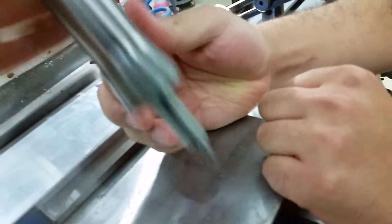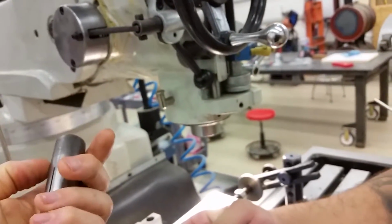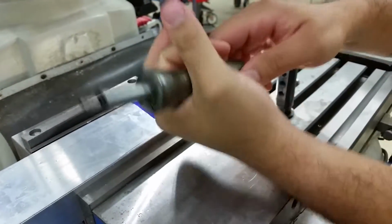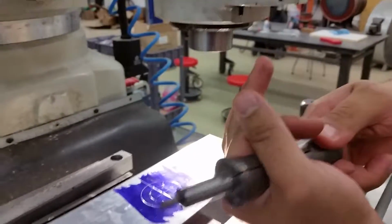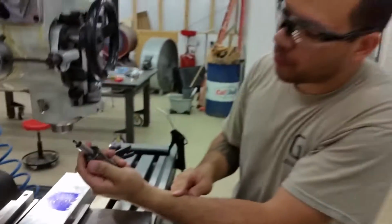First we should tell you that the other side has a threaded inside. And then when you pull this up, because you use the, this is spinning the threads of what looks like a dowel, but it's called a drawbar. Right. That pulls it up, which then squeezes it, and that is what keeps it tight in there. Yeah, so the drawbar is pulling on the back end of this collet. And then the nose of the quill here has the same taper as this. Right in this area. I don't have a light on it, but anyway. Since that's fixed and you're pulling on this, it squeezes down on the OD here and grips the tool pretty securely.